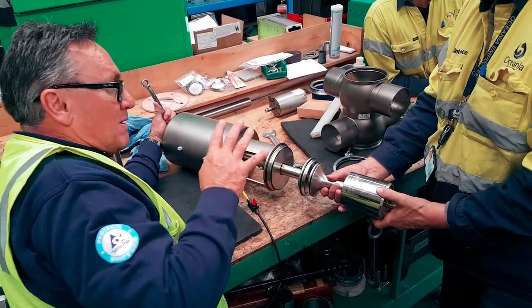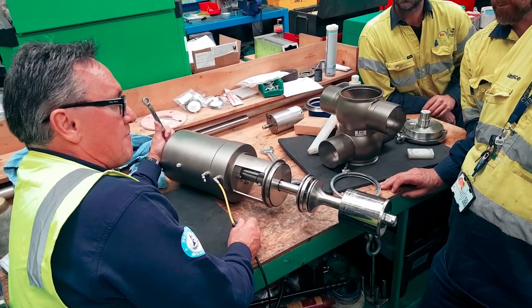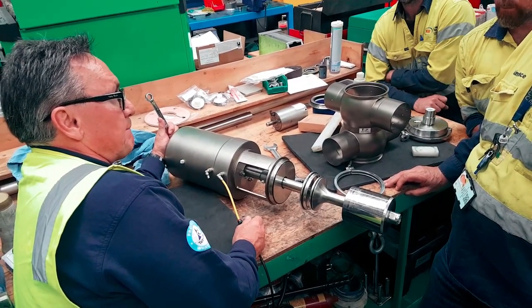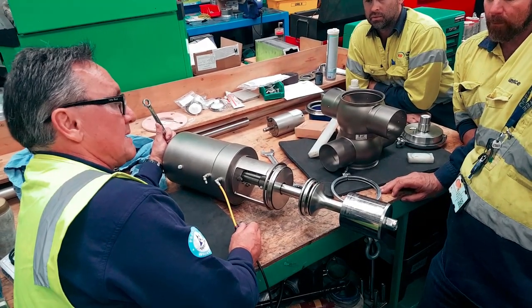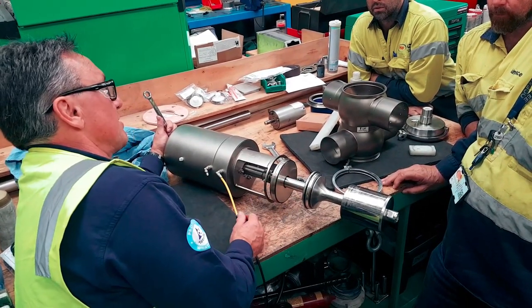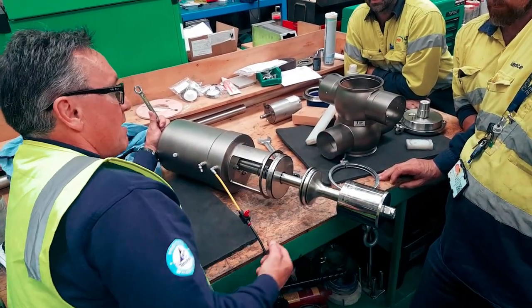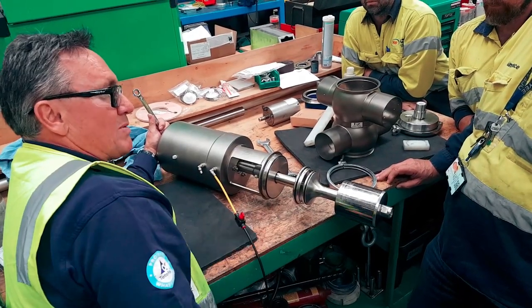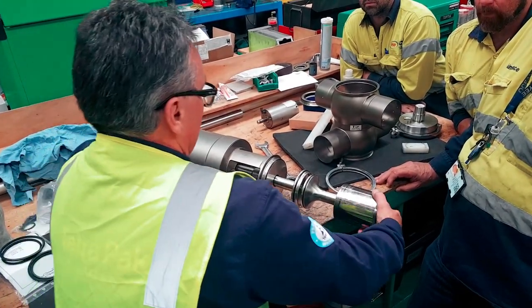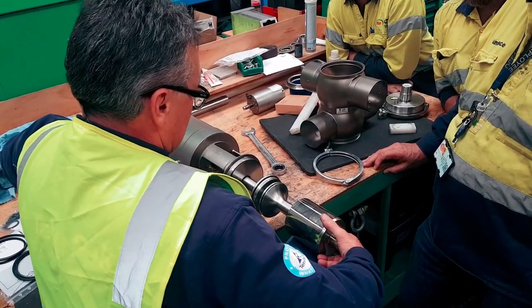What I'm saying to you here is that it's okay to undo it with the air off, but it's not what you need to do. Because I'm replacing those seals, it doesn't really matter. But what I'm doing is putting tension here. When I torque this back up, I'm giving myself a false sense of torque if these are enclosed in each other. So that's why we take them off, and it's a lot easier. If you're doing this by yourself, you'll probably find you put your knee there like that and screw it off.